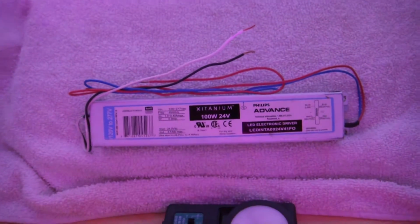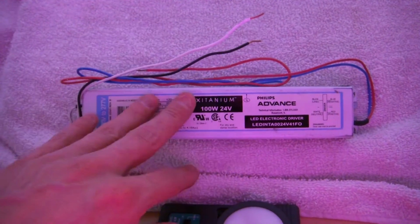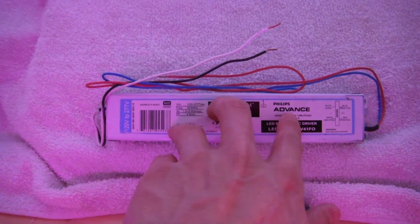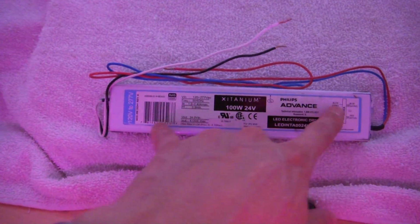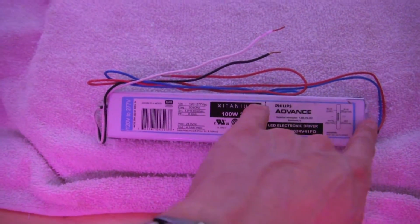So when you have what's called a brownout, besides surges, which are an instant killer, all of this is stressing to make sure that the output is the correct output. And when you don't have enough input, it will kill itself and deplete itself to make that output. So you need an uninterruptible power supply.